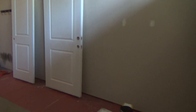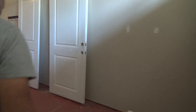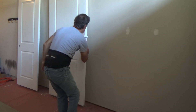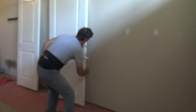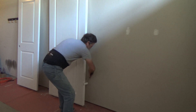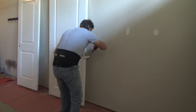So that's how I've got to do these edges. I've done the top of the door down to the door knobs, and now I'm going from the door knob down. Because the door is tilted away from the wall, I don't have to move it. I can be careful around the latch so I don't build up the paint.